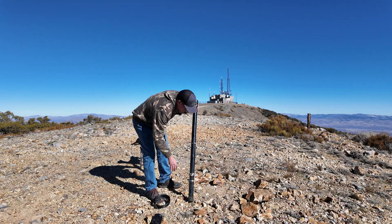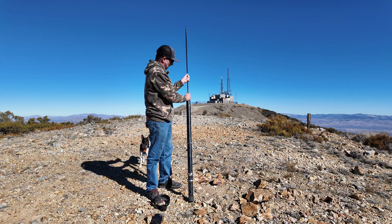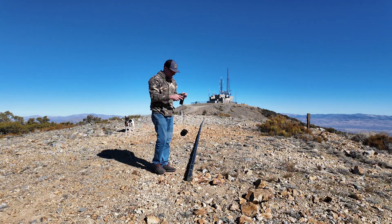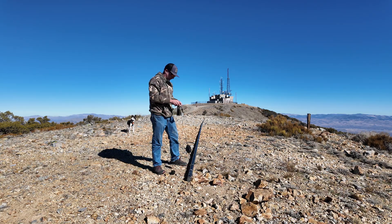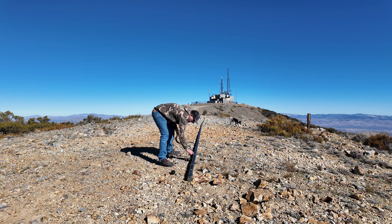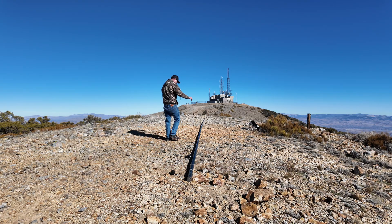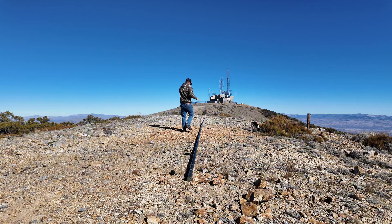The first thing I'm going to do is find the top of my mast and fully extend it on the ground, being very careful not to screw it up. Now that the mast is fully extended, I'll pop these zip ties off. I'm going to leave my transformer at the top of the bottom section and then run out the wire carefully to the tip of my mast.